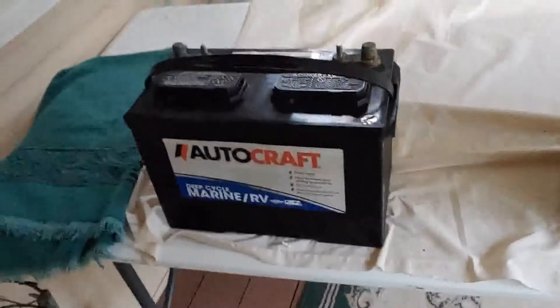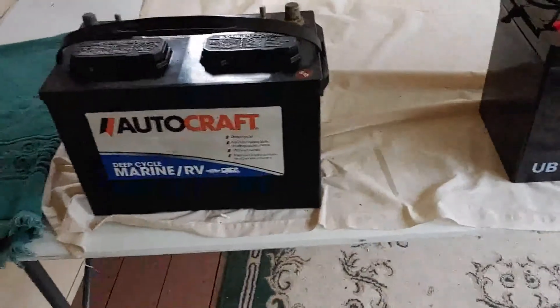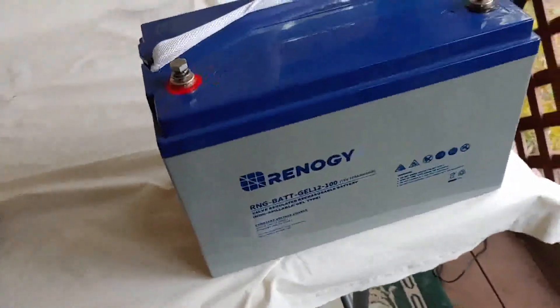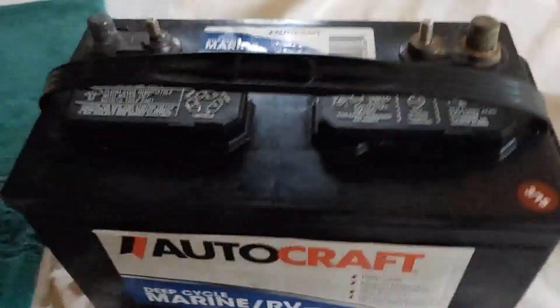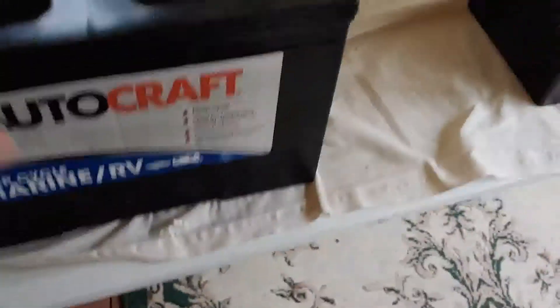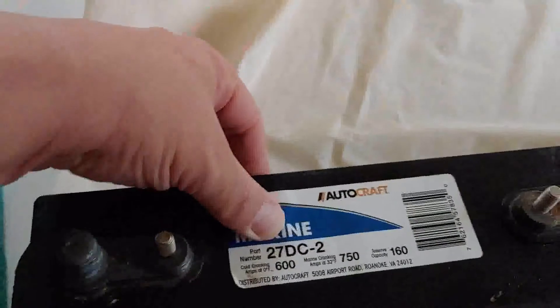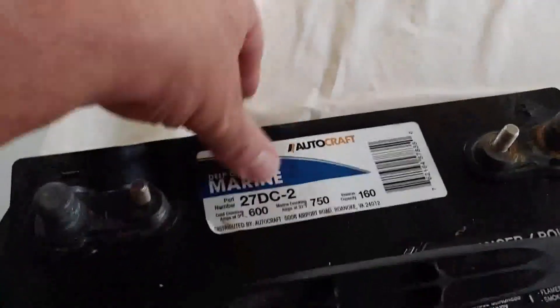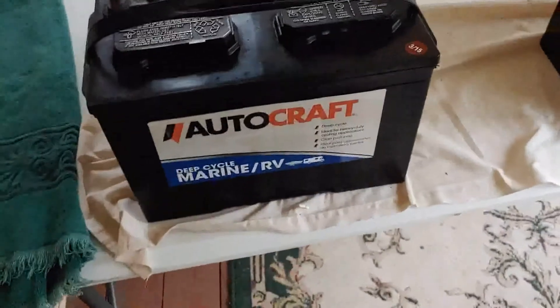Shoestring has a rule when it comes to discharging: never discharge any battery below 12.1 volts unless it's an emergency. That's my rule and it's always worked well for me. Just remember, once you pick your battery type, stay with that type. If you're setting up a small solar system and you purchase one first, make sure you buy other batteries for that same system just like this one — same type, in this case 27DC2. Make sure they all match together; they'll be much more functional, last longer, and discharge and charge together really well.